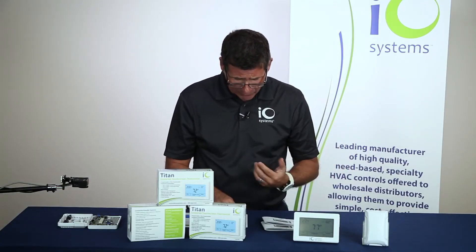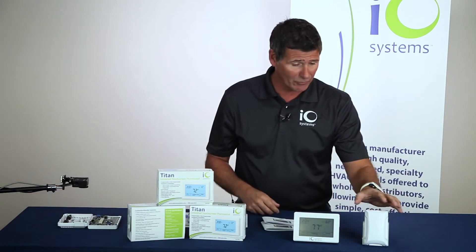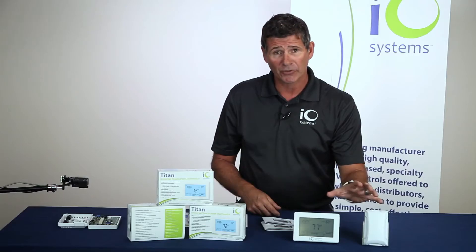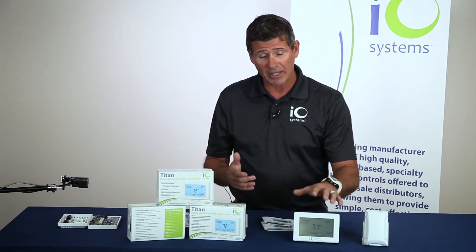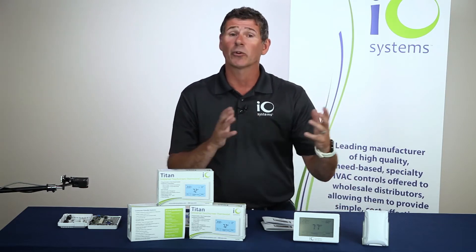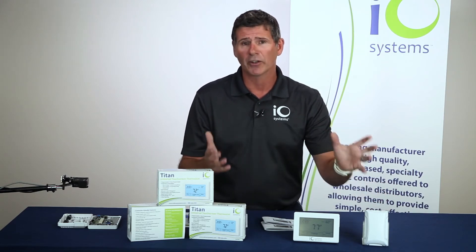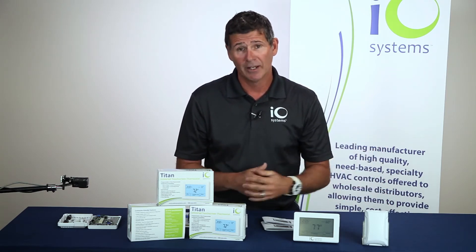You can do adaptive recovery with this thermostat. There are indoor and outdoor optional wired sensors. On my left — your right — we have what our indoor temperature sensor looks like, which wires directly into the back of the thermostat. You can do up to nine temperature sensors if you want temperature averaging. Wiring in one sensor disables the onboard sensor, which is useful if the thermostat is in a closet and you want sensing in another room. You'll need two sensors for temperature averaging, and a heat pump setup will want the optional outdoor sensor as well.